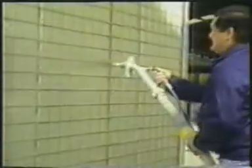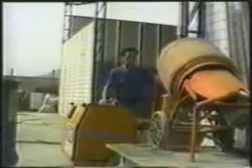With lightweight panels, after washing the wall, you proceed by spraying a flash coat of roughly 6 mm thickness on both sides. This will act as a binding bridge between the polystyrene and the mesh. Once the binding bridge is done, you may prepare the guides in order to receive the first coat and later on the second coat of a variable thickness until the room is finished. If working with lightweight panels, you must take the precaution to load both sides simultaneously until the room is finished.